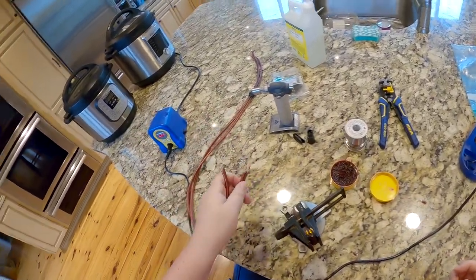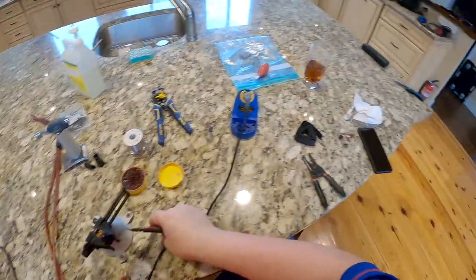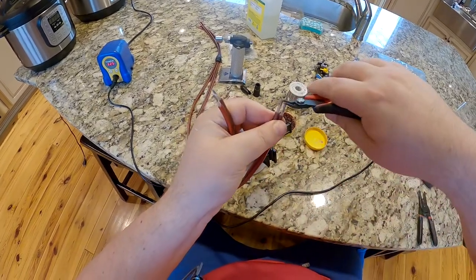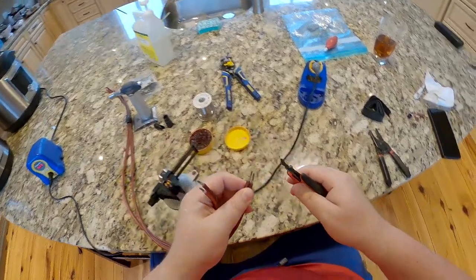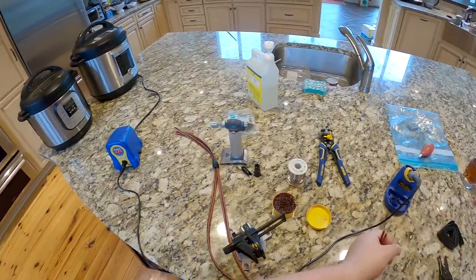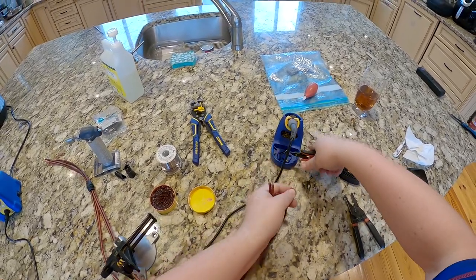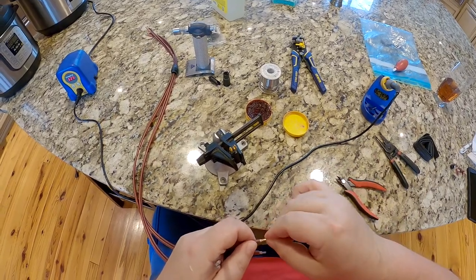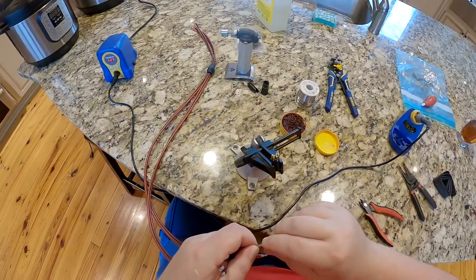Now, which are the ones that were too long? Just barely too long — and I'm gonna take the good cutters. When you cut this it's gonna end up on your floor and when it ends up on your floor you're gonna step on it and it's gonna penetrate your foot because it's so sharp. Look how uneven this got — these are completely uneven. That one's gonna have to come off that much just to make them the same length. How did that happen? Shrinkage. We're gonna cut the long one short and then cut this one to match.